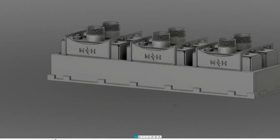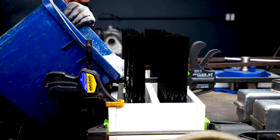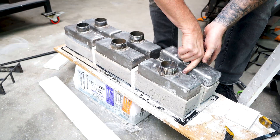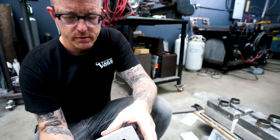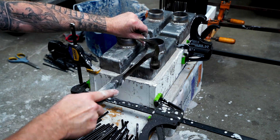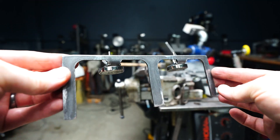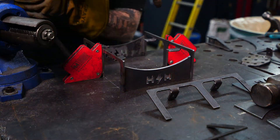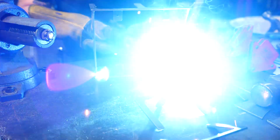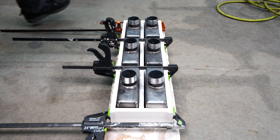This week I've spent a ton of time designing a bracketing system. Last video you saw how I poured the refractory for those six ribbon burners — they popped out of the mold just fine, even after I forgot to spray the mold release. One of the major problems was getting those burner bodies to sit flat and level in the refractory. The solution was to create M-shaped brackets that sit on the mold with magnets that hold the mold at a specific height. Those were easy to make but harder to tune, calibrate, and figure out the spacing. We did come up with a good solution, though we haven't fully put it into play yet.